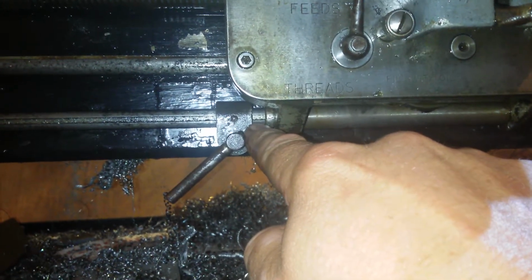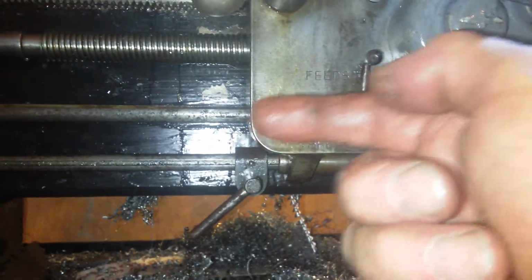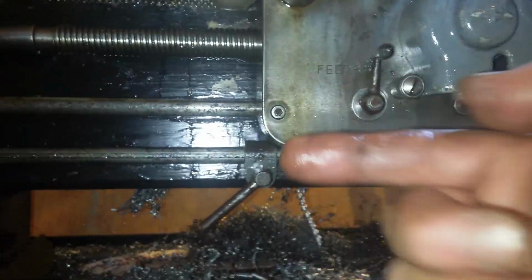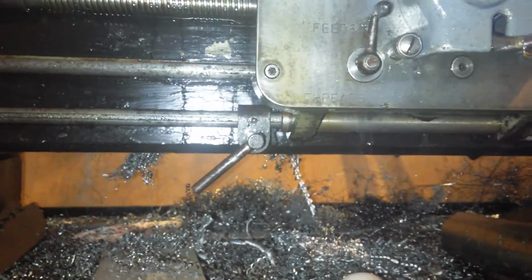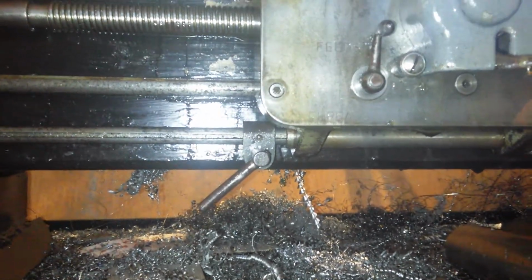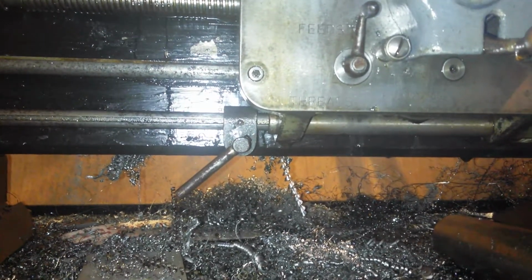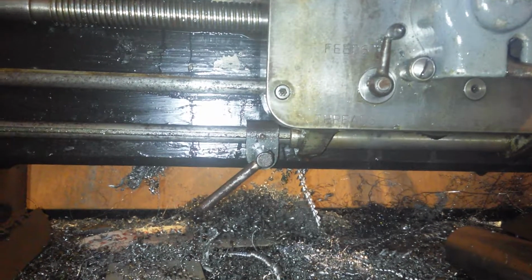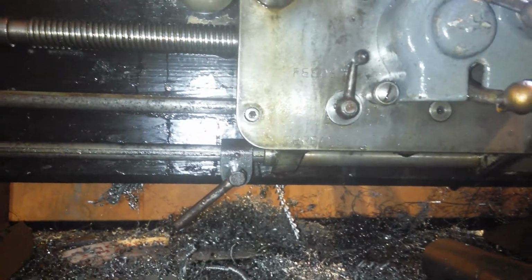And when I'm doing the milling with the carriage going that way, I'll obviously increment it bit by bit, locking it off every time and taking a cut until I've got all the way down until I hit the lock stop. And then we'll have a land which should be approximately the right depth and the right width, approximately.